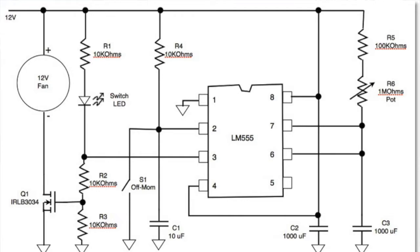To drive that MOSFET, I use the 555 output off of pin 3, and I bring that down through R1, through a switch LED, and then through a couple of 10K resistors. My 12 volts gets charged off of the solar panels, and solar panels can put out a lot of voltage — you've got to be careful. My charge controller limits that to 14.2 volts for the bulk charge. 14.2 divided by 2 is kind of high, but the maximum gate voltage is like 20 volts, and you can take it as low as 3 volts. So I did basically a 3-to-1 divider with an LED in there, and that works great.